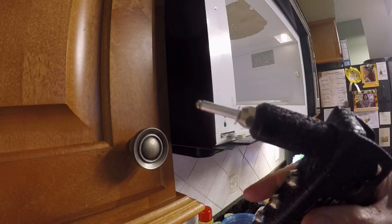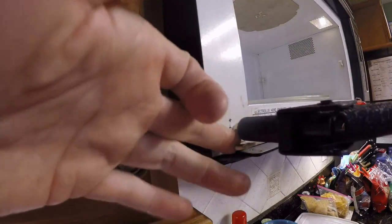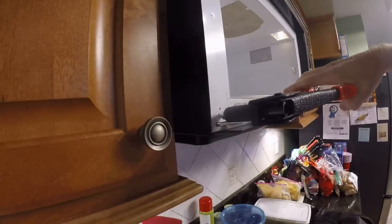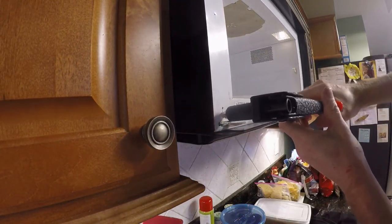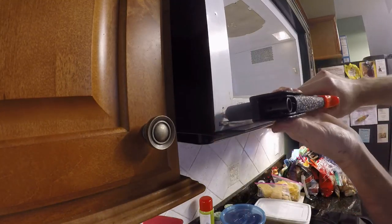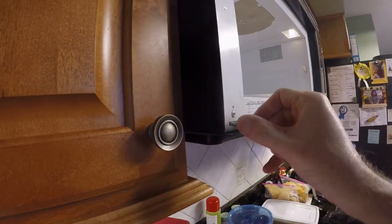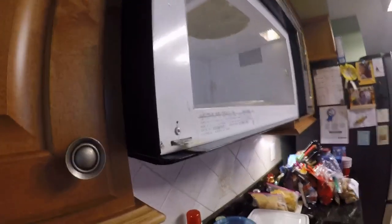I found a smaller rivet that will go right through. I hold this hinge out and start cranking on this puppy. Keeping it pulled out, it kind of takes care of itself — getting tight. Keep the rivet gun flush as it's getting close and it'll snap when it's tight. And there you have a rivet to hold this in place.